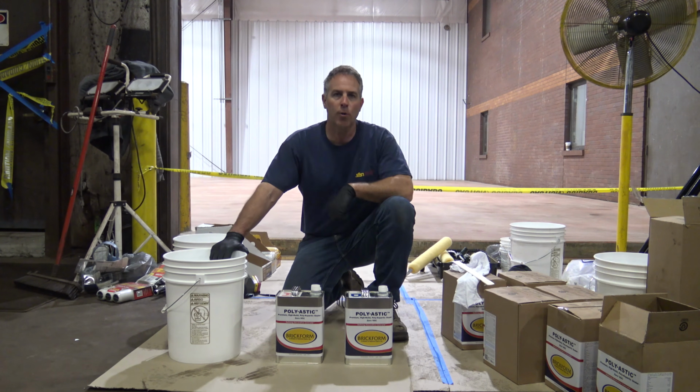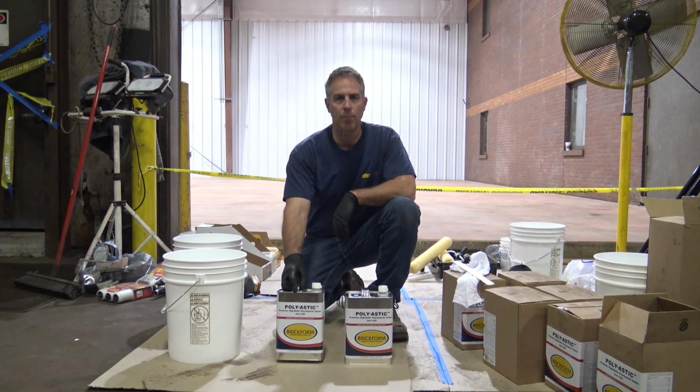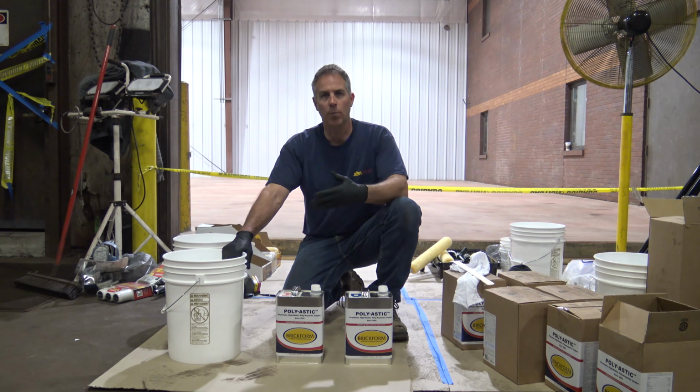This floor we used our Pro Dye Plus, which is an add water or acetone dye, and we did that yesterday. We've been drying out the floor for the last 36 hours to make sure it's good and dry. And now we're ready to mix this sealer up. It's very simple. The only thing you want to be careful with is that this has a pretty short pot life. So when we mix this up, we want to be ready to seal.